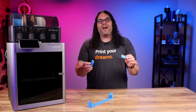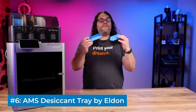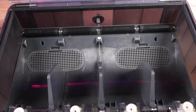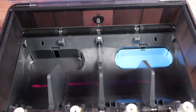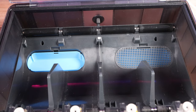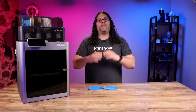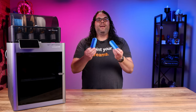It really does a great job of keeping this thing upright while your build plates are in there. For number six I want to talk about the AMS desiccant trays. These little guys fit into the desiccant tray area in the AMS and they allow you to fill them up with loose desiccant — not the little packages that come with the machine, but actual loose desiccant. This version allows you to use the stock cover, which looks natural, but you can also print a cover in cool colors. It's much easier to fill these up with loose desiccant and then recharge them by baking when saturated. It's more economical and better for the environment because you're not buying little packets all the time.